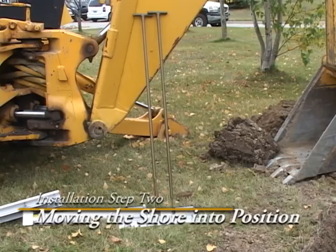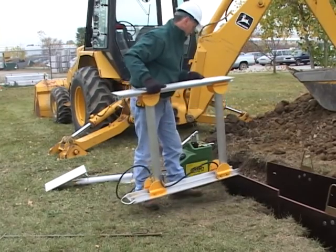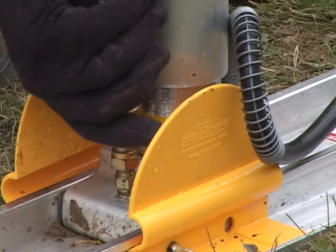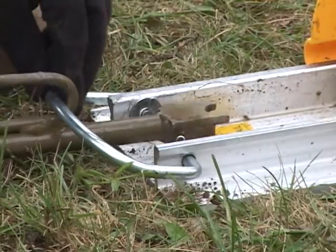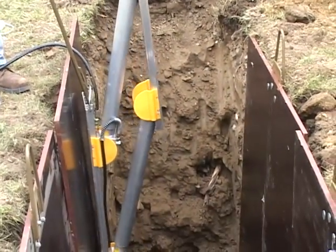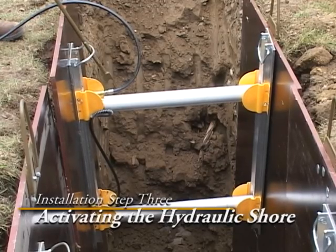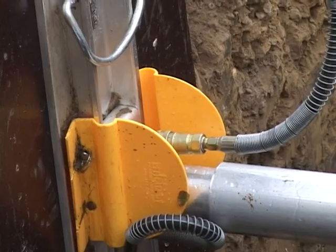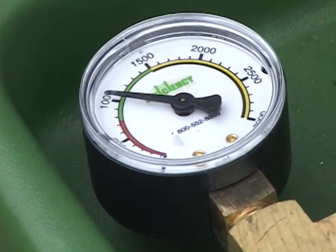Two different tools will help you position the shore: the release tool and the removal hook. Lay the shore down with the fitting side of the cylinder next to the ground. The hose fitting will slide over the quick coupler fitting on the cylinder. Place the release tool under the handle and fold the shore down. Pick up the handle and the release tool and walk the shore into the trench. After the shore is properly positioned, close the quarter-turn valve and begin pumping the fluid into the cylinder. Pump the cylinder until the pressure gauge reads into the green area, or approximately 750 psi.